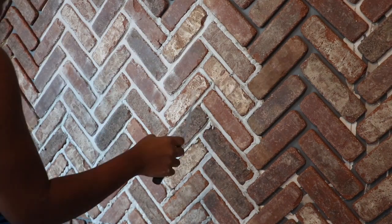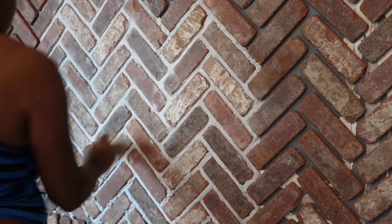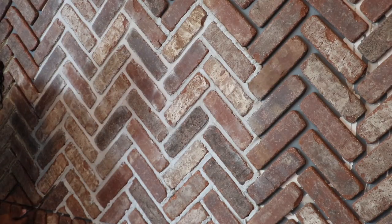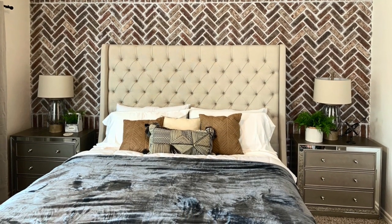After shaping the grout with the trowel I went back with a little bristle brush to get all of the excess pieces off. When you're doing this grouting make sure you have plastic wrap down because it will get messy — I mean messy — so have something to catch all the excess grout. Once you wipe off that excess grout and cover everything, you're basically done. Afterwards I wiped the wall down and put a sealer on it to seal all the brick, and that was it.